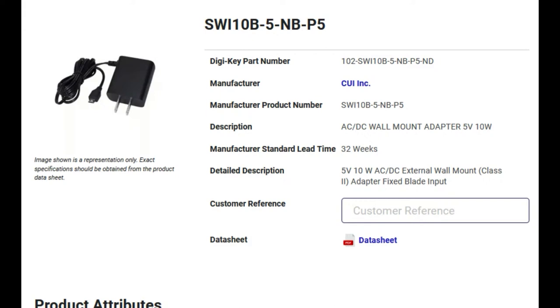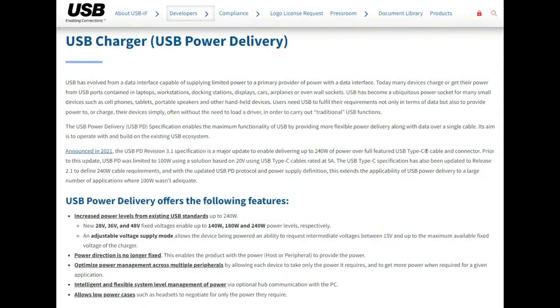Stuff powered off a lithium ion battery is great because lithium ion batteries are 3.7 to 4.2 volts — you can power and charge them from five volts, you're good to go. But this doesn't solve the problem for larger devices. People basically said: if you have a tablet, 10 watts is actually not really enough to charge or run a tablet or a laptop. So the USB Implementation Forum came up with the idea of power delivery, which you're starting to see in a bunch of devices.